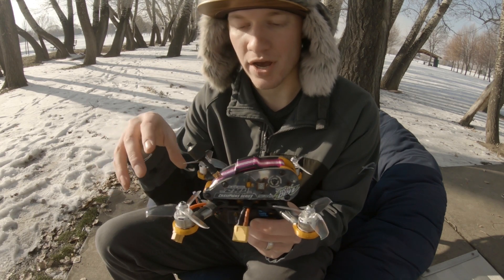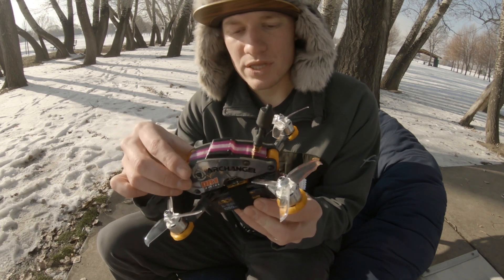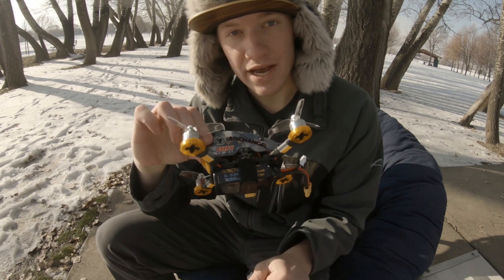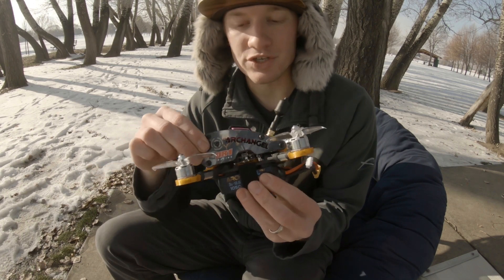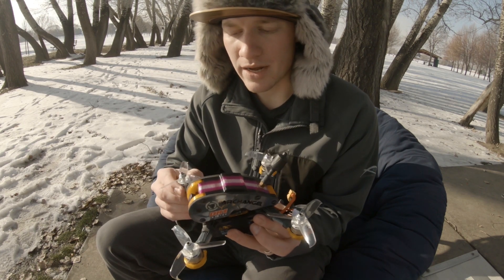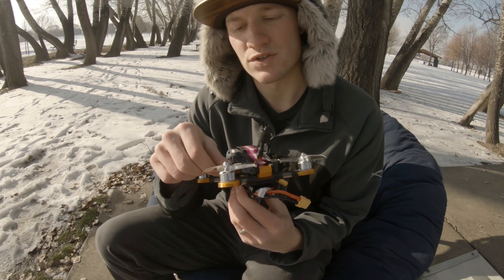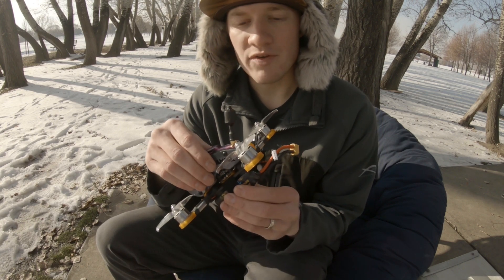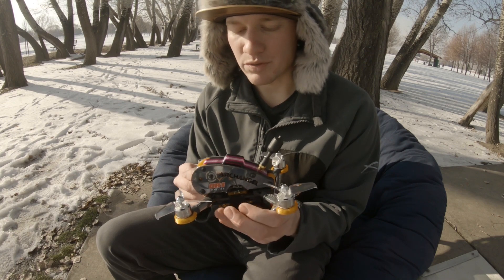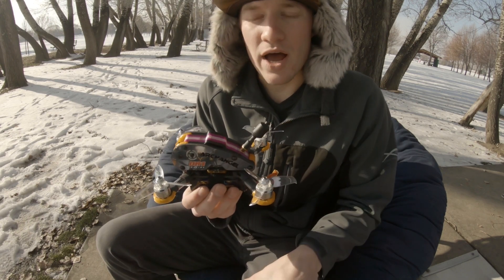It's running some pretty impressive electronics. This quadcopter uses the latest HGLRC 20x20 stack, which for its time is one of the more proven and tested stacks in the 20x20 size market — keeps the weight down without limiting features. It comes with an onboard OSD so you can see things like voltage and telemetry in your goggles. I'm using the FrSky version here. It's also using 1507 4000kV brushless motors swinging a 3052 prop, so plenty of power. Running a 3S battery, it should fly like one of its bigger brothers while being small and highly maneuverable in these trees.